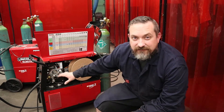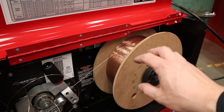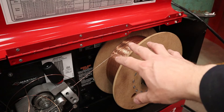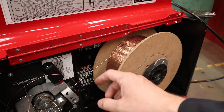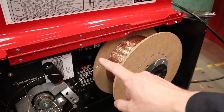There are really only about five reasons why you'd have a bird's nest. First up: your spool of wire has to be dead clean. If there's any contaminants — like rust, maybe you're welding outside, using old wire, or there's a ton of dust — any of that goes in with the wire, gets into the liner and feed mechanism, and if it builds up enough you'll have a solid jam and a bird's nest.